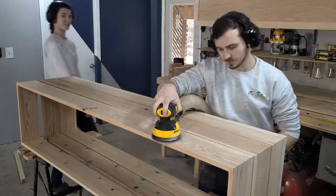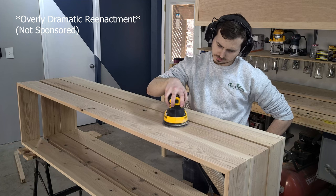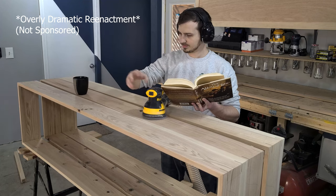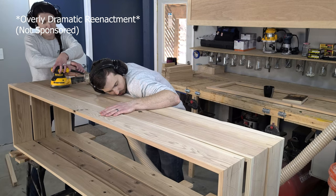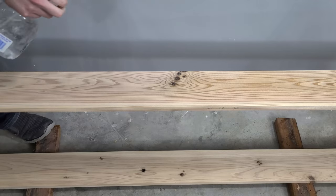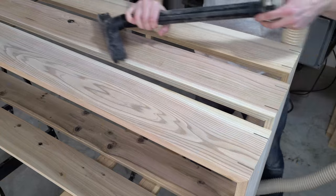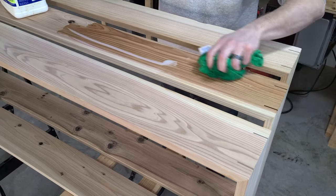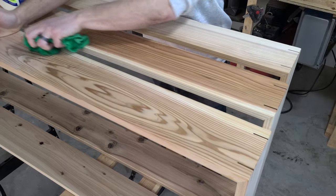We're done with all the pieces — time to make it pretty. We start our finishing process with one of the most important steps: sanding. Nobody likes sanding, which is why we recommend you get yourself a good orbital sander and use the 3M Extract sandpaper — link below. This stuff is amazing and it makes sanding go so much faster. Because we want this to look extra fancy, we're going to water pop between grits and sand the exterior faces up to 180 grit. Then we quickly vacuum the dust off the boards and wipe them down with mineral spirits to clean them, set up a fan and leave them to sit overnight.